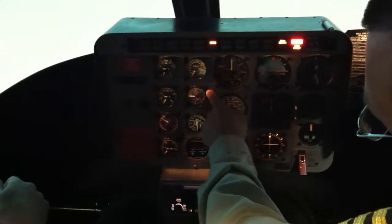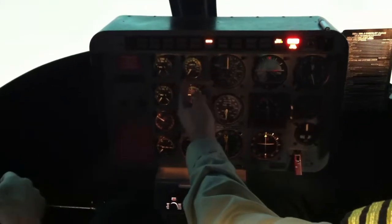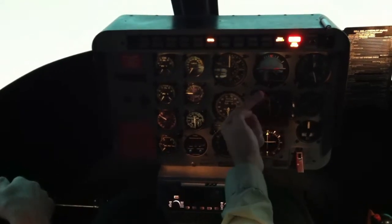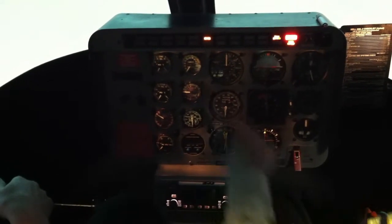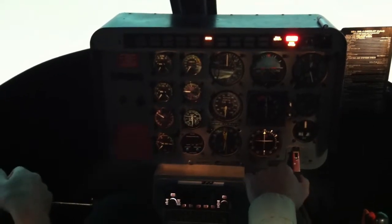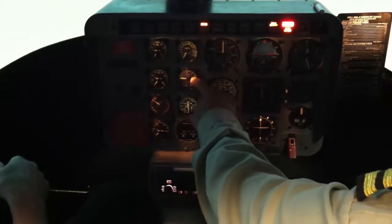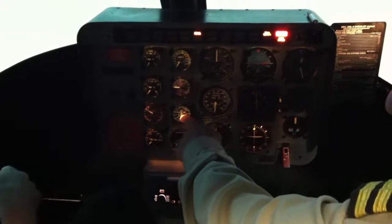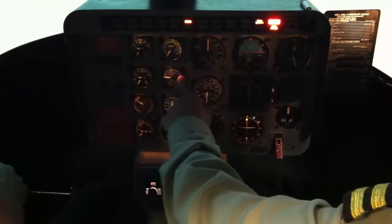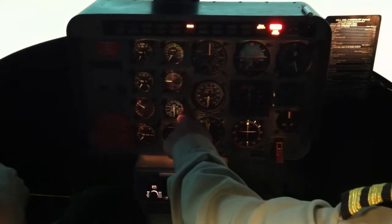It's going to come up here and peak around 650-ish, then come down. It's going to peak a second time on its own. As it starts moving down from that second peak, start rolling on that throttle to maintain the top of that green. Your eyes keep going back and forth — initially you're looking here, you come down to see when you're going to light it, then you come back to see how high it's going and to modulate that fuel to keep it in the top of the green.